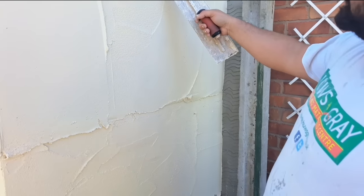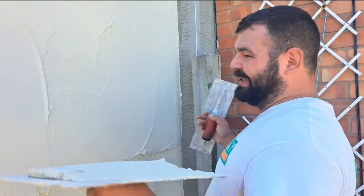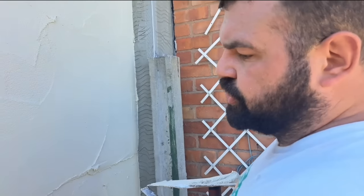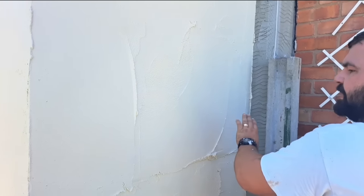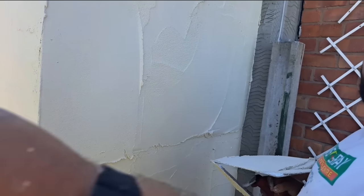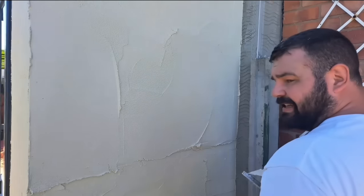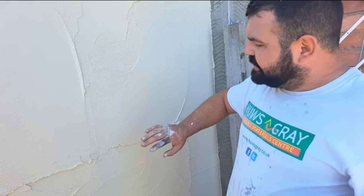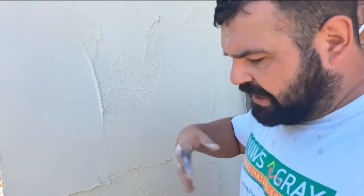See — first pass, second pass. I've dropped down the band now, so I'll put the second pass in, then drop down again, second pass in again. I don't want to keep going on about it — it's not really super necessary on little walls like this, but trying to show you the principles, because if you're on a big wall this will save you. You always want to go the shortest distance as well. The whole thing about this system is just trying to keep the join wet where you're joining into — that's all you're trying to do. If that starts getting a skin on it, that's game over. You can have white lines all over your wall.